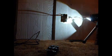Okay, looks like I lost the ears out of this box. They fell down on the wall, so I'm gonna change the whole box out. I got extra boxes. Okay, just more work added to the job. I'm gonna have to notch this hole out a little more in order for that new box to fit in there. I'm gonna do this without cutting the wires.